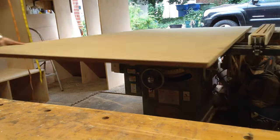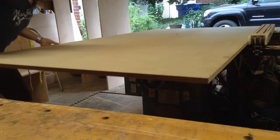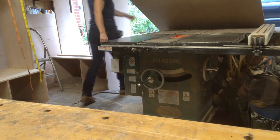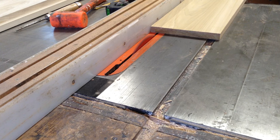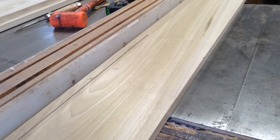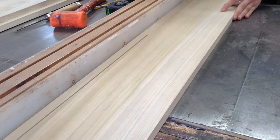What I didn't show in the last video is that all the upper cabinets are sitting on top of an MDF bench top base. I usually don't use MDF — it's extremely heavy and the dust is quite toxic — but this is going to be a laminate top and I find it to be flatter than plywood. I'll show you the laminate process a little bit later.